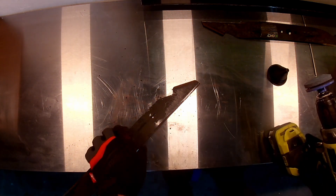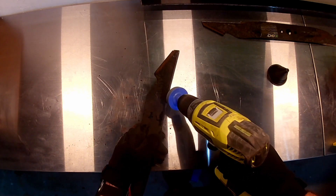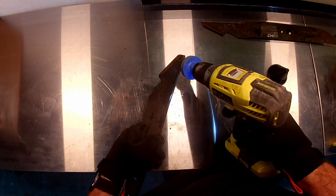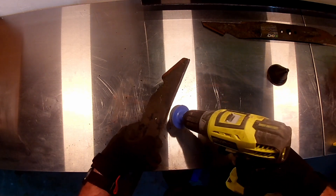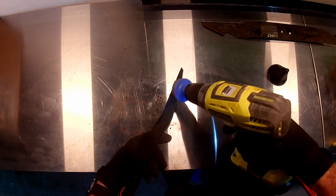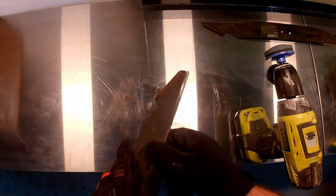Here I'm going to use the front of the grinder to just hit the back of the blade because I really want a sharp blade. I'll clean up the face of the blade and turn it around — I want to make sure the back of the blade is also cleaned up so it has a little bit of a beveled edge. You want to monitor how sharp it is and how much you're taking off, because when you go to balance it, even a little bit can throw the whole thing off.